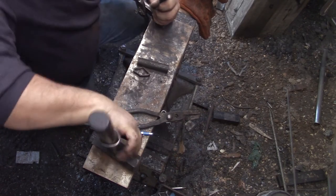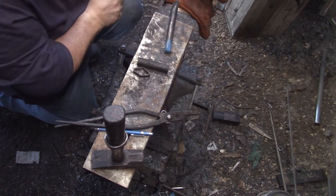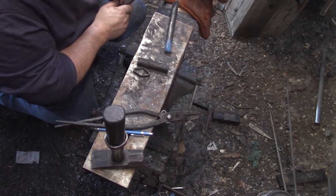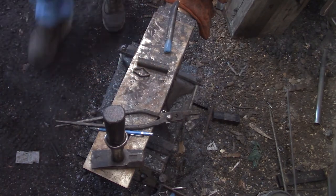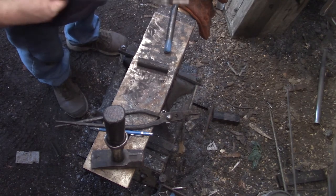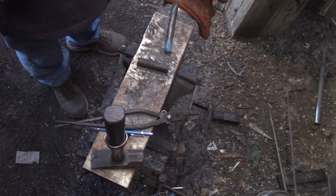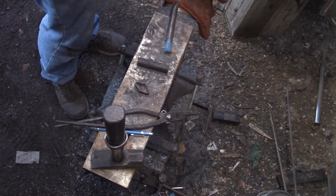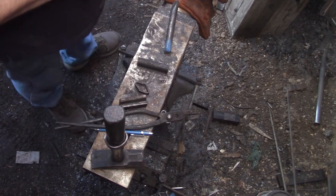The pair there on the anvil by the hammer is a good solid fit from quarter to a half. Although the goal of these was to get from either a half or five-eighths to an inch, because I used the same pattern and all I did was bend the bit a little more, it's going to keep the same spread — and it turns out the spread's three-quarters to an inch. I can get a nice parallel fit, or close to it. It's not going to be perfect at the extremes or in the middle, so that's where modifying the bit — which I'm going to do a video on — comes into play.